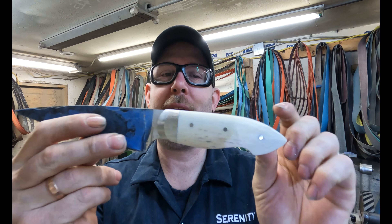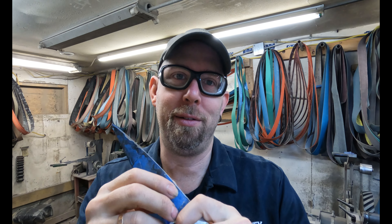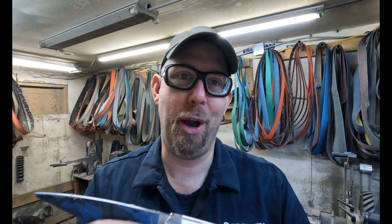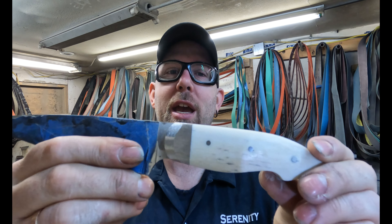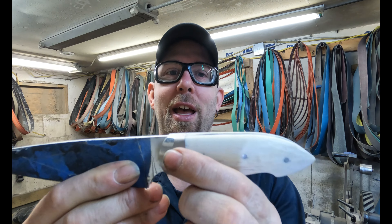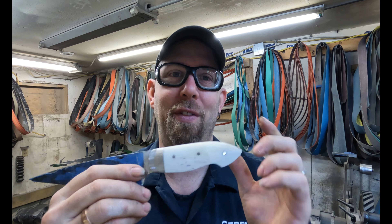Good morning, it's Wednesday, February 7th. I did get some shaping done on the custom magna cut, but I really forgot how hot 304 or 316 stainless gets, how quickly. Not wanting to hurt the bone or the epoxy, I could only grind on it for a little while before having to put it down. I just don't like putting knives at this stage in water to cool off the handle. I'd grind on it for a bit, work on something else, and keep coming back. I did get up to 80 grit and got the chamfering on the front done.